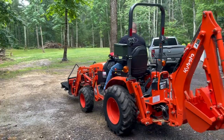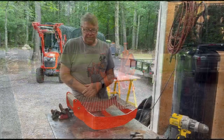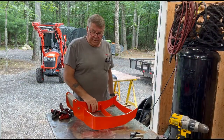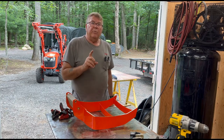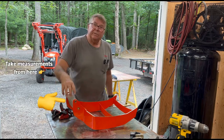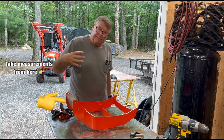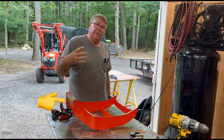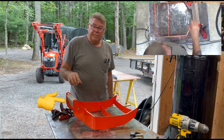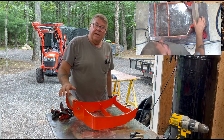We're heading off to the metal pile for the expanded metal. I removed the front cover, or the front guard here. One important thing to do is to measure the distance on the tractor and cut a block to fit in here, because what happens is it springs forward. When you go to weld the piece on, it won't fit because it'll be too narrow.